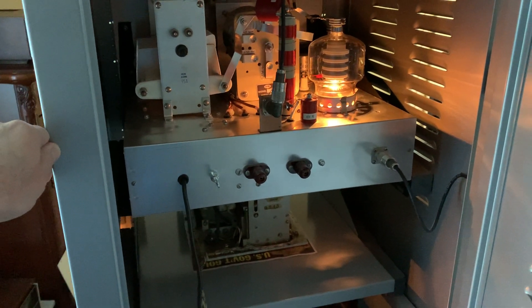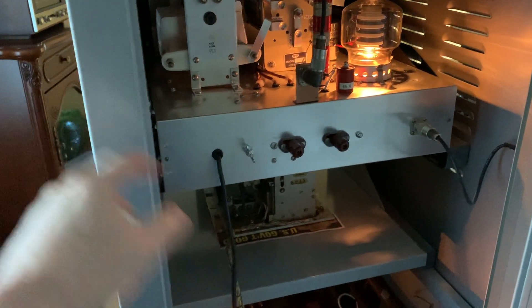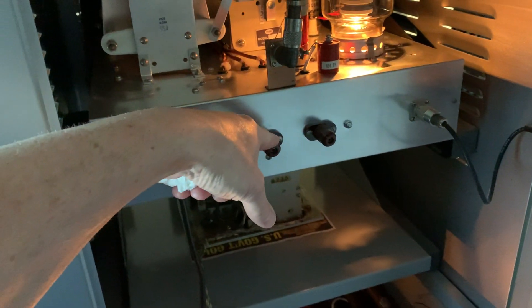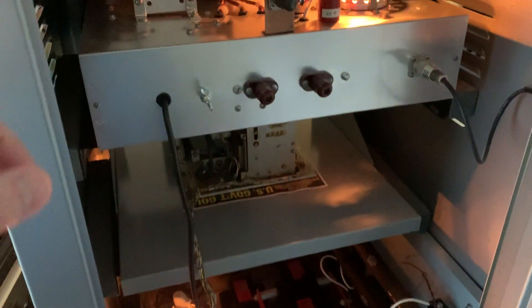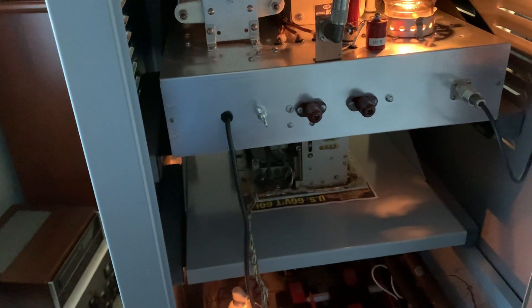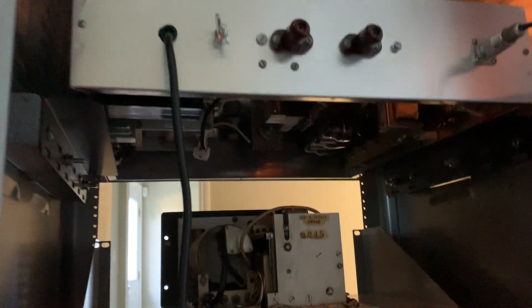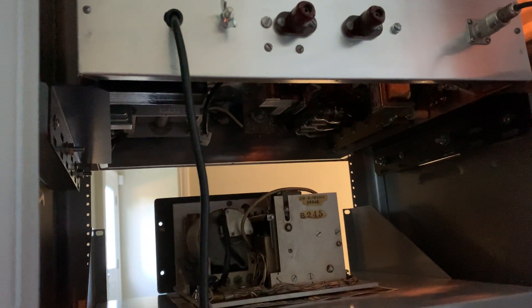I was almost done with it a few years ago when I did all the modifications to it. What I've got now — I think this is the plate and this is the screen. The screen voltage is going to connect down to the cold side of the modulation transformer, the B+, and then the other one's the plate of course. I've eliminated the bias supply deck and it's going to get its bias just from the drop in resistors. I've got components up in there and I've got regulator tubes for sideband and everything, so it's going to be cool.